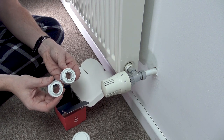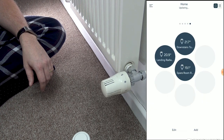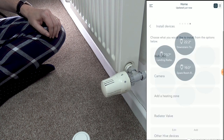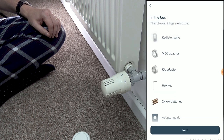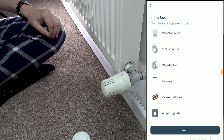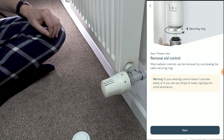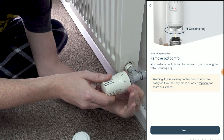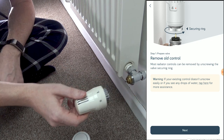Let's get rid of the box and start the setup process, replacing this valve. Launch the Hive app — you'll see I've already got some radiator valves installed. Go to Add, Install a New Device, click on Radiator Valve. It tells you room by room; we'll do Start. There are some instructions — we'll skip that. Next, it tells you to unscrew your existing valve. Be careful if the radiators are on, as the valves will be hot. To do that, it's this metal ring underneath here — just unscrew that all the way and your valve simply pops off.